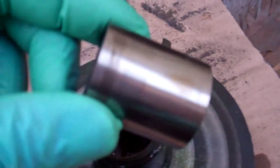I've managed to get that bearing out. I worked the crankshaft and put some release spray down there, worked it back and forth and it came out. It's got a few scuff marks on it but there's no real major scoring — you can't even feel it with your finger. That's nice and smooth. It just seems to be a fairly tight fit in there.